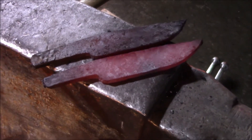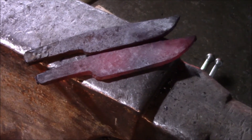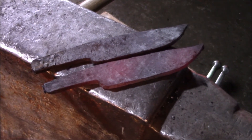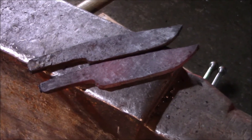What we'll do now, Wayne, in order for me to get as much tang as I want and about a four-inch blade, I'll grind into my tang shoulders here so I can clean that all up. I'll give these guys a little bit of profile work, make sure I've got the edges good and clean, grind them flat, and then we'll start grinding some bevels in them — going to have a couple of hollow grinds.